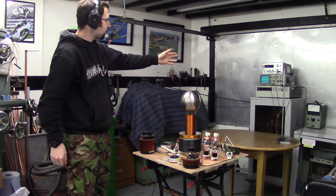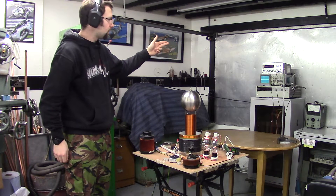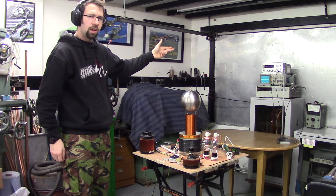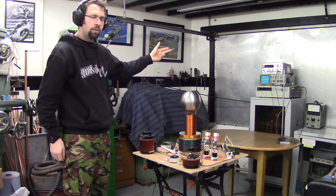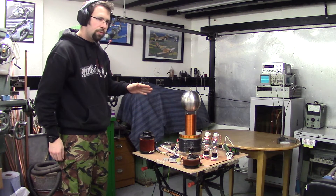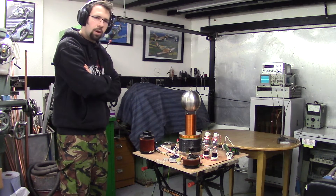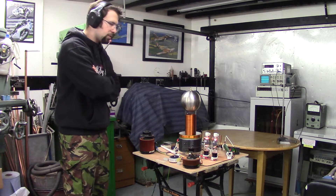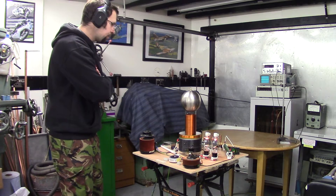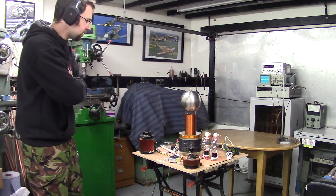I've also got the oscilloscope over the back there and the frequency counter, so you can see the waveform, which is a nice oscilloscope waveform. But the frequency counter, guys, don't pay much attention to it, because I know it's getting confused between the 50Hz which this emits and also the 320 to about 400kHz. This actually runs at its resonant frequency around about that — 360kHz is about normal. I've been tuning it so it changes a little bit, but last time I checked it was about 360kHz.